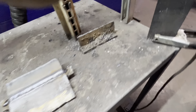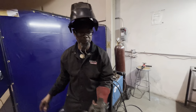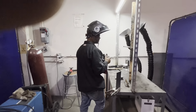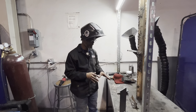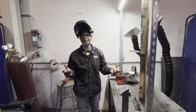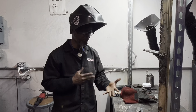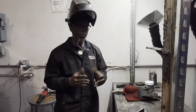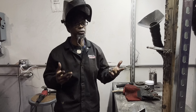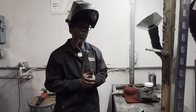Flux core welding is a lot different than regular MIG welding and stick welding. With stick welding, the process takes a lot longer because you're throwing down rods and picking up rods. But one thing this process does that I like about it — it eliminates the tie-ins except for when you got to stop. You can get some porosity if you lose your gas or if you're not staying close enough to the plate, allowing the gas to seal the weld.